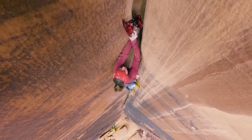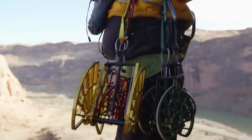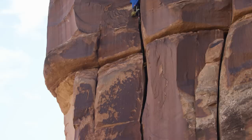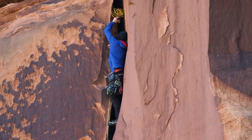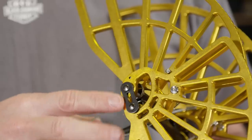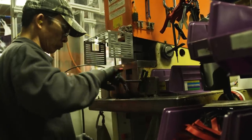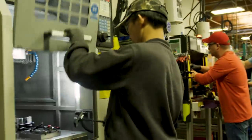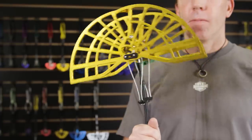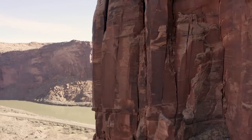Construction-wise, it's really similar to the number four, five, and six. Still dual axle, similar sculpted lobes, similar construction with the cable, the thumb loop, and the sling. We used larger diameter axles in order to get the strength where we need it on these rigs. The stem tube plastic had to be a little bit thicker wall — we needed that to get it stiff enough because of the added weight of the head. You didn't want them to flop around too much, so that thicker wall actually made it more functional.